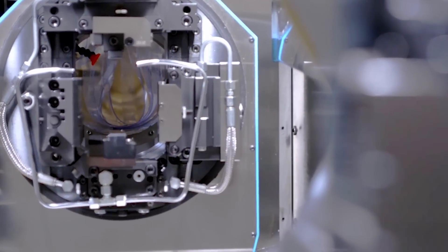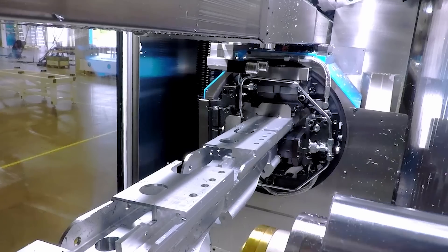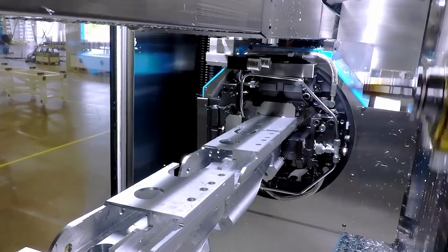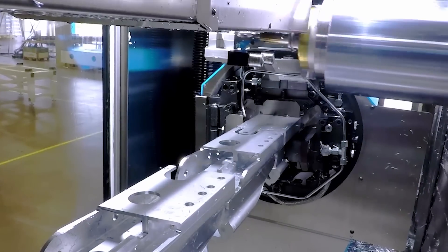Maximum part size is 6 by 10 inches for extrusions and 5 by 5 for bars, with options for larger size raw material. The HHV handles uncut bars and extrusions of unlimited length and can produce many parts from that same block.